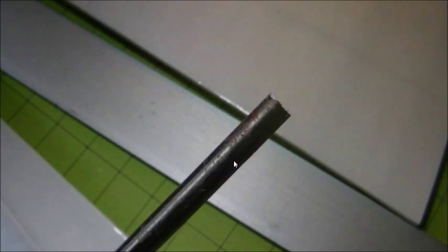If you look, this is a part of one of those outdoor solar-powered light fixtures. This is a small one, about 3/8 of an inch or maybe a little more. I take my Dremel tool and serrate the edges of it, clamp it into a drill, and then it becomes a hole saw. It makes a nice little round hole in foam board. I kind of like that.